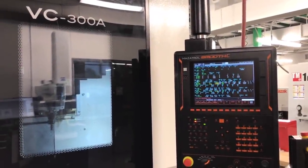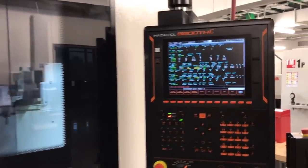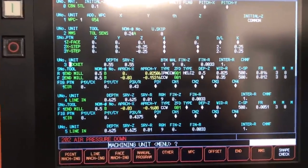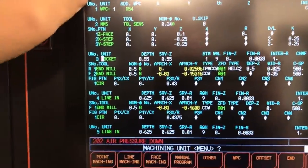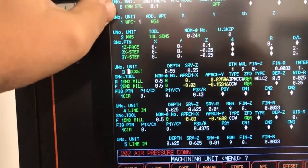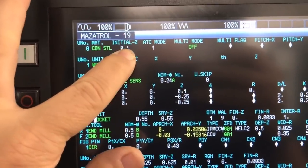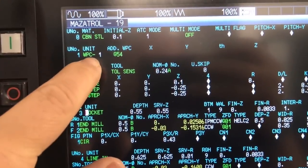Okay, I'm going to do the mill work on this on our Mazak VC300A. It's a small machine, but it's a really, really well built machine that does a really nice job on this. Now I'm going to talk about a couple things in the program here. I did this in Mazatrol, okay? So I used carbon steel for my material. Initial Z high is 0.1. Then I put my WPC in,